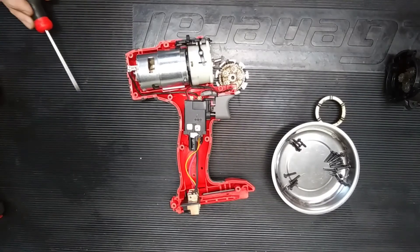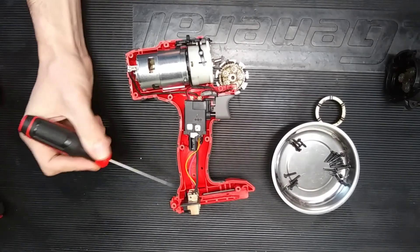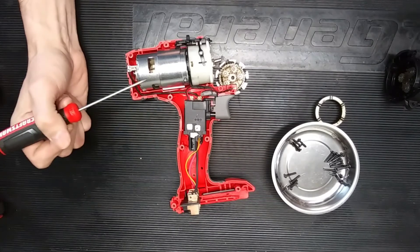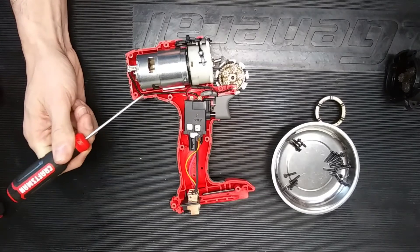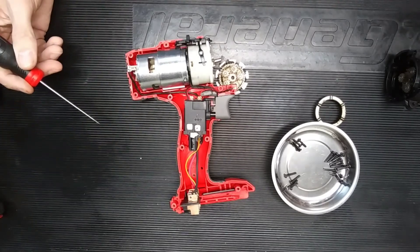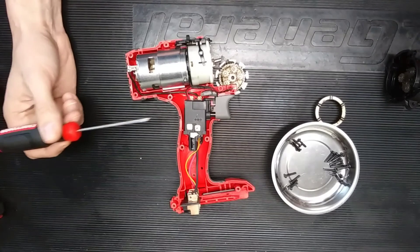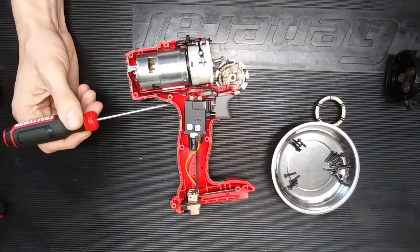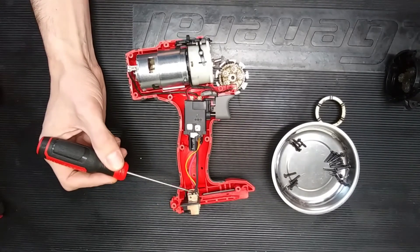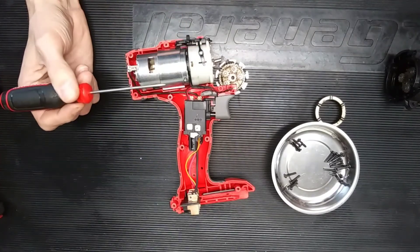Overall, I like the construction — I think it's high quality construction. The housing is very well designed with the screw bosses, the tongue and groove features, the soft grip and the way it's locked into the housing — very nice. I like how snug everything fits together. It tells me that when they were dialing in the tooling, they got it pretty accurate. Everything is nicely fitting, nice and snug, not too tight and not loose. That's going to affect the longevity of the tool positively. I like the simple battery pack attachments — nice overmolded terminals, not much to go wrong there. And like I said, I like the metal gears in the gearbox.